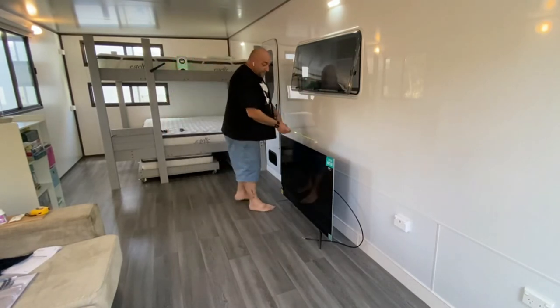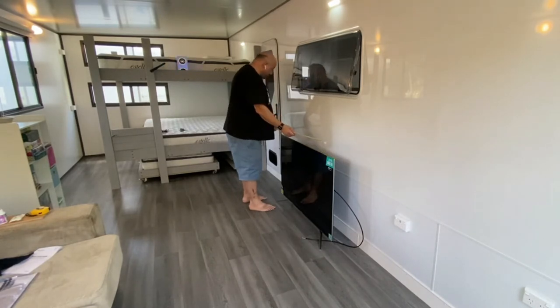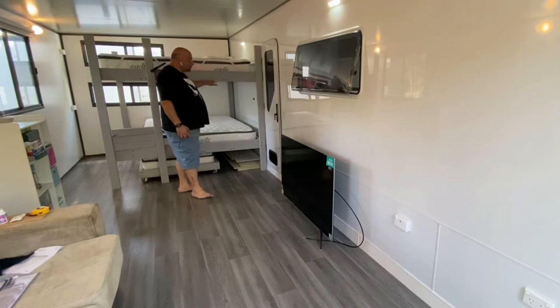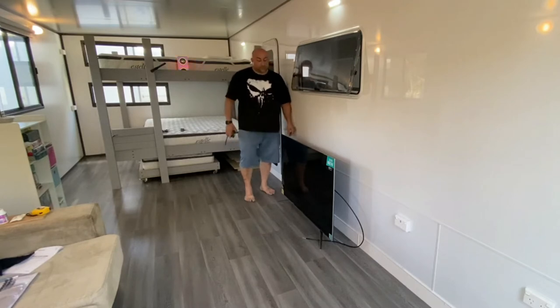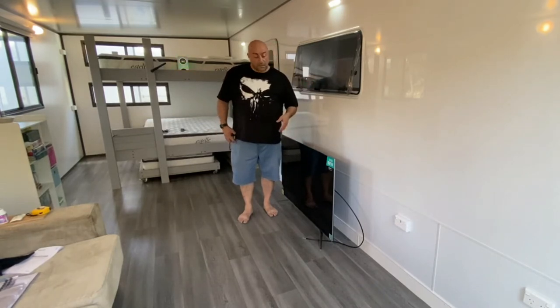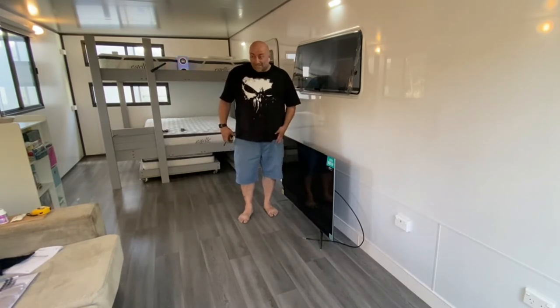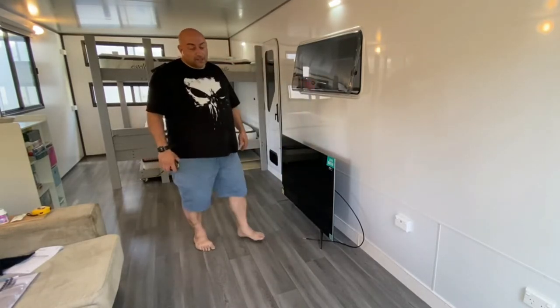Alright, so now this is actually, what's that, 1.2? So I think we should be making it around, say 1.4, with a little bit of space either side. And then width-wise, we're using two of these boards, which is going to be 280, which is more than enough for the feet. And then we've got to work out a way of potentially fixing the legs to the unit, so if it does get knocked, almost the entire thing has to fall down, which is going to be pretty impossible, because you can't trust kids. Doesn't matter how old they are. Alright, so let's go outside and have a look at the bits and pieces we've got.